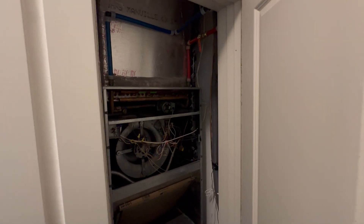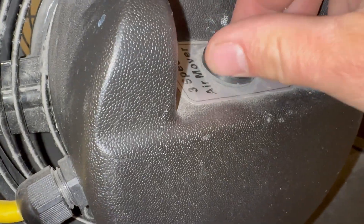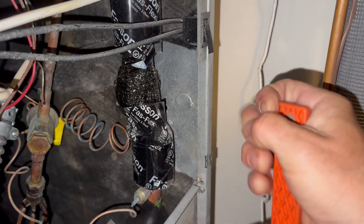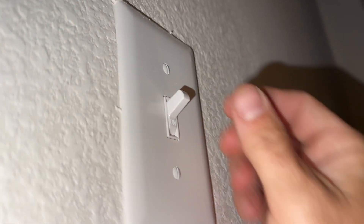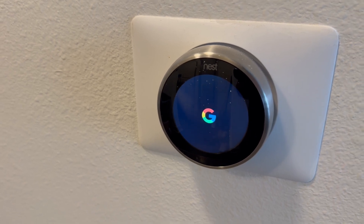So I put a carpet fan right on where everything was leaking and I'm going to leave this on there for about 25 to 30 minutes. Everything looks dried out — nice and dry — so I'm going to bypass this door switch and reapply power to the unit. I've already reset the breaker — let's see if it holds. Thermostat powered right on, breaker is holding.